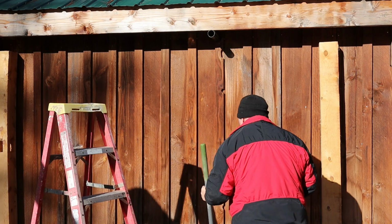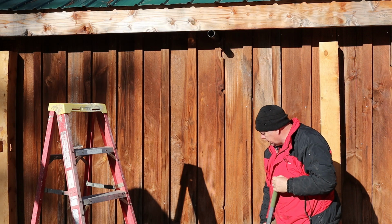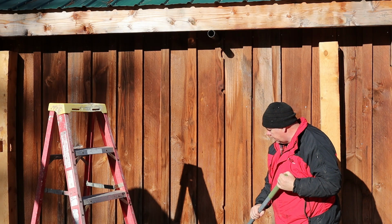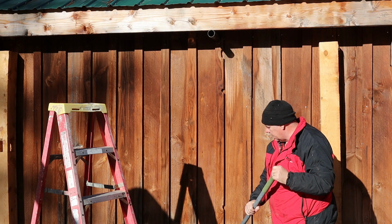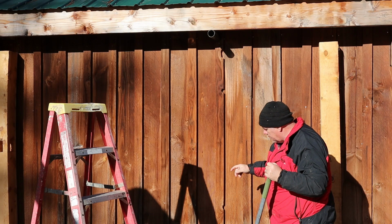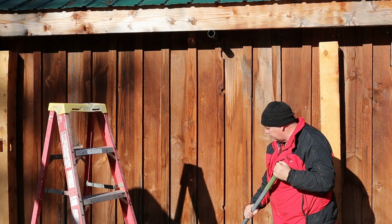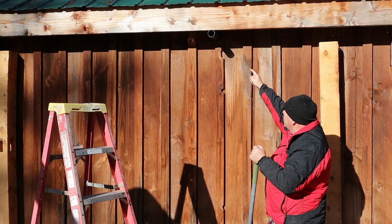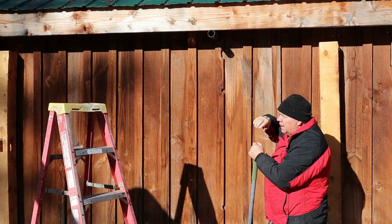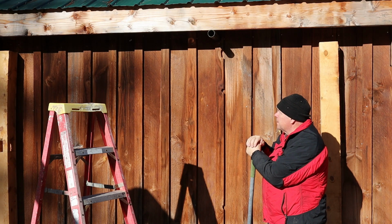This is where that sewer comes out. That restroom back here, sewer comes out, goes to the main septic field. There's going to be a kitchenette right here with a sink directly over it, P-trap type thing, reduced down into that. So I'm going to have to carry a vent for this P-trap in the sink, and I'm going to carry it up and hook it into that vent, which I have two possibilities in attempting to correct that.